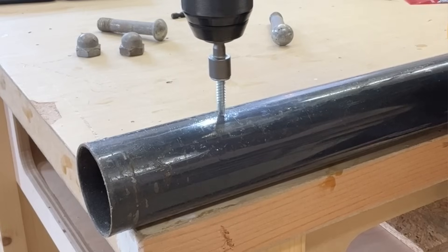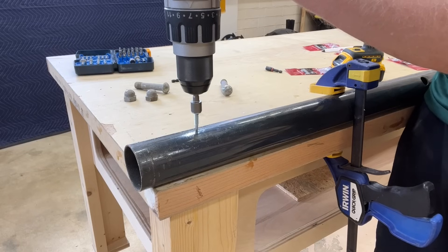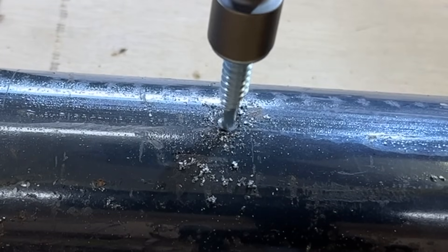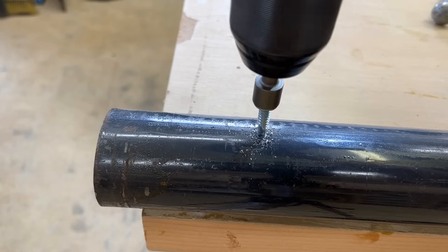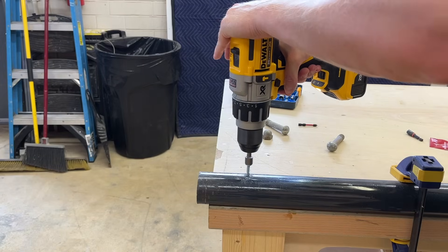Very quickly, the head of the screw will begin notching a pinpoint in the metal. If it doesn't, you can use something like a metal punch or even just a sharp nail to create a set point, but I often find this isn't necessary. Drilling metal is more about pressure than speed — you don't need to spin extremely fast, just somewhere in your mid-range. But you do want to maintain constant pressure throughout the start. This helps the screw head begin to cut. As seconds go by, you'll begin to see the head kicking out metal shavings and forming a conical depression. It's paring out the walls of the cut little by little. You just have to keep going like this until you begin to hear the drill whining at a higher pitch — it's encountering less resistance now as the head bores fully through.